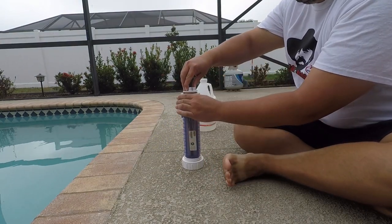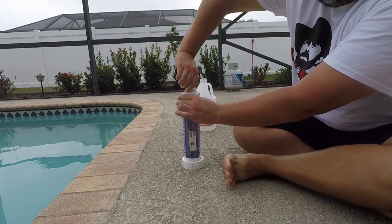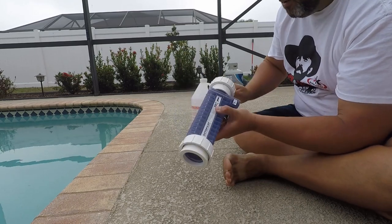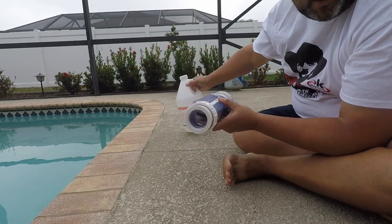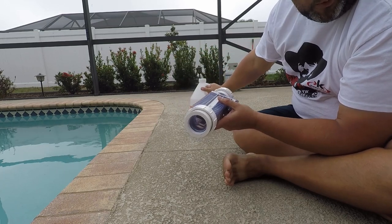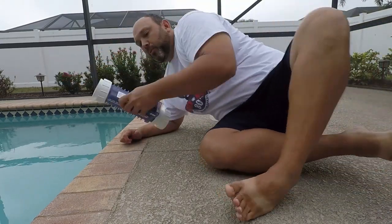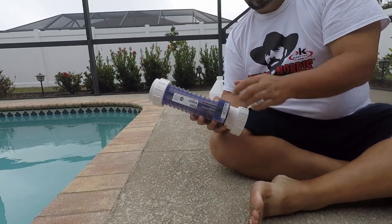We're gonna take our plug and put it in here. Get it going. Okay. Now what we should be able to do is put water in without seeing a ton of leakage at the bottom. Alright, you typically don't want to have a 1-to-1 ratio. It's about a 5 parts to 1 part ratio. We'll do probably a 3-to-1 here. So we're going to do about 3/4 water here in our salt cell. I'll just grab it from the pool water. Make sure we don't get any muriatic acid on our two connections here.